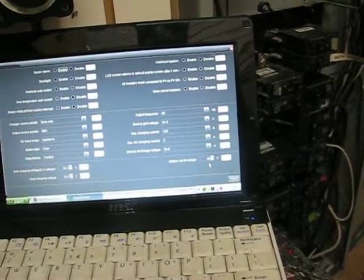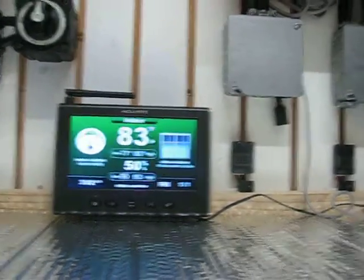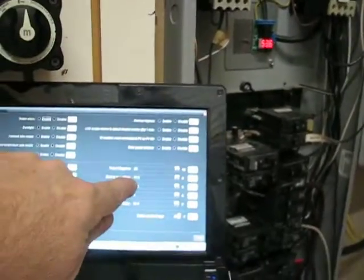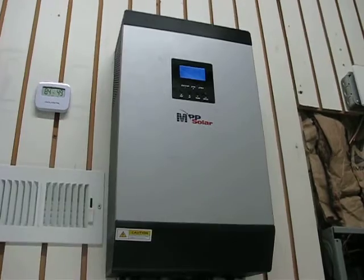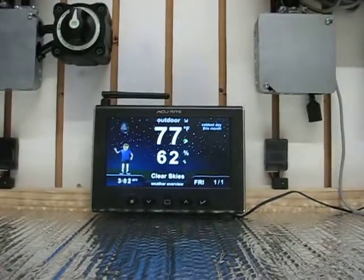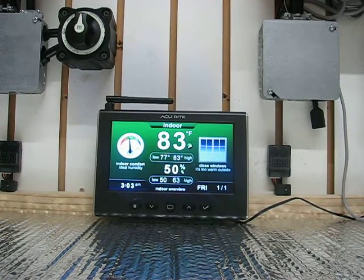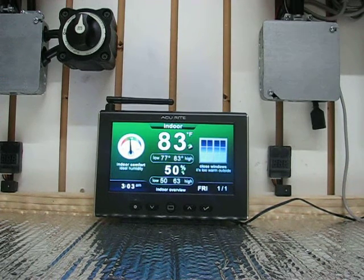Now man, I got all kinds of cool stuff going on when I get these switches hooked up. I'll do another video and show you guys, but I'm going to have this inverter on probably 24/7, or work with a voltage control switch where I'll be able to extend these parameters to anything I want. And this unit will be on a timer that'll only be on when the hot water and the air conditioner are on during the daytime, and then when it switches off, I'll have that unit switch off, and I will have doubled my efficiency of my system. I've been doing this manually until I got the Wi-Fi switch, and then I just ordered all the stuff to put both of these on Wi-Fi, or actually Bluetooth, and we'll see how that goes.